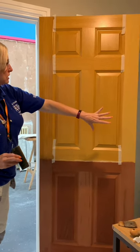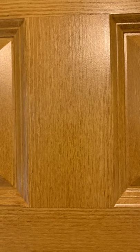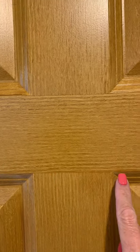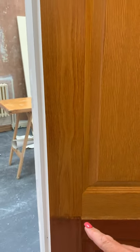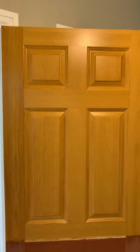That's one side — I'm going to do the other side the same and then varnish it. At the end of it, if you've done it correctly, this is how it should look. If we go close, we can see that it actually does look like oak, because we've gone through all the processes. You can see how each part stops like natural wood. We've got that nice big long open grain down the side, which is another characteristic of oak. So that's what your finished door — one half of your door anyway — should look like.